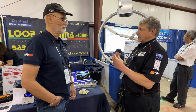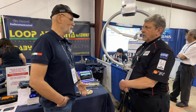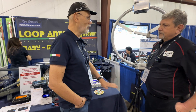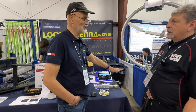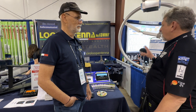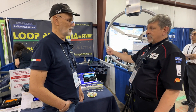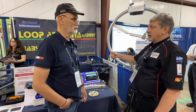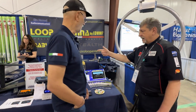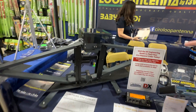We always recommend a rotator so that you can take advantage of its directivity. The height above ground for the baby, between 5 and 8 feet, is going to be determined by how good your ground is. You can use it on a balcony; however, when it's made from wood, we would recommend to have some iron on the ground — metal sheet metal, no bigger than one square meter. And the heart of the baby loop and the midi, which is the larger model that covers 80 through 10, and the stealth loop, which is a portable 40 through 10 lower power model.